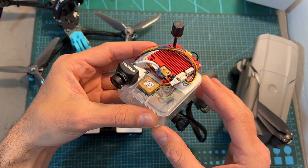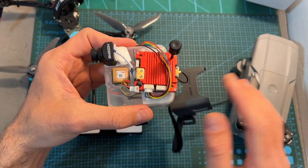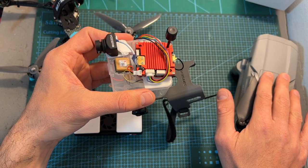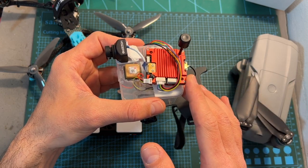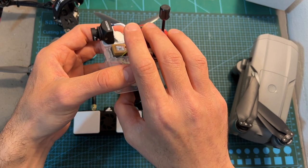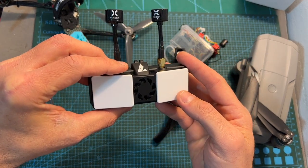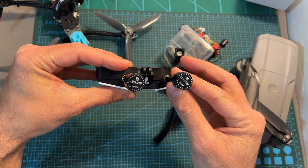The next thing that I've done is to head outdoors and test the HDZero Freestyle VTX using my Mavic Air 2, which was restricted to 2.4 GHz in order to prevent it from interfering with the video signal of the VTX. The VTX was set during this test to the maximum output power of 1 watt, and I've tested the receiver setup using the stock patch antennas and two omnidirectional Foxeer Lollipop RHCP antennas.